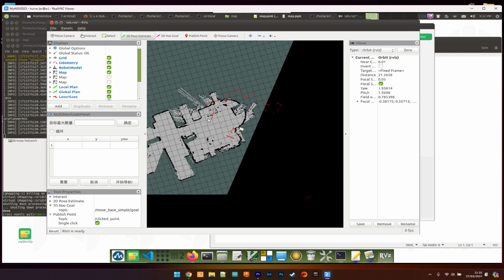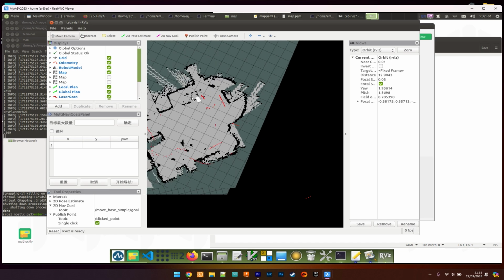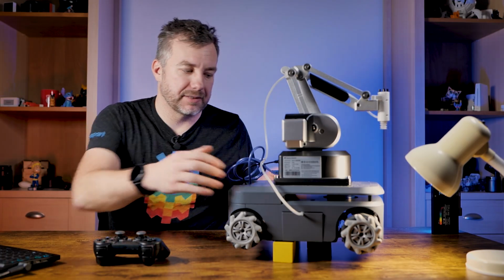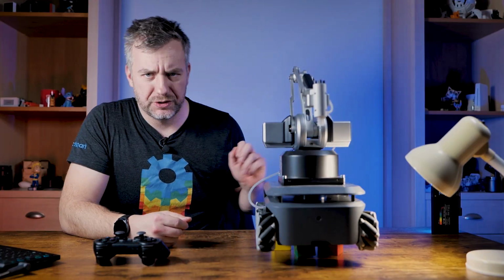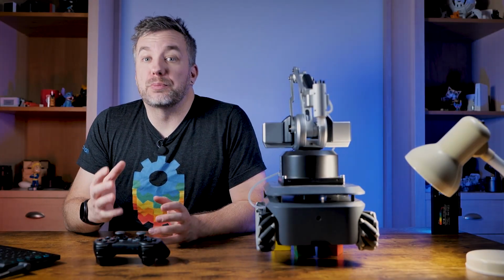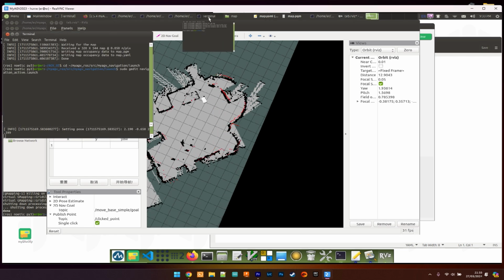Once the robot is on the ground in a selected position, go to navigation and use the 2D pose estimate arrow to indicate the origin of the robot and also point the arrow in the direction the robot is facing. The face of the robot is where the camera is, just if you don't know. Now, when you do that and place that arrow, nothing really will happen. You'll have to go back to the terminal window responsible for launching this software and obtain the XYZ coordinates.